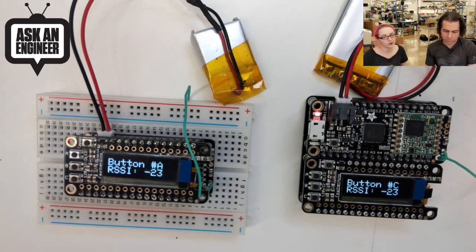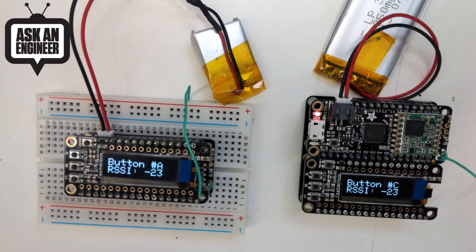These are great. We're going to have another radio that's much bigger, but 20 dBm is the limit for a lot of ISM bands. These are great, super easy — 900 MHz and 868 MHz for USA and European ISM bands, and 433 MHz for European ISM bands or amateur radio. All right, good work Lady Ada — that was new products for the week. Good job.